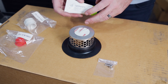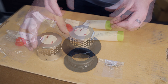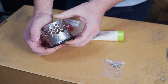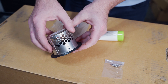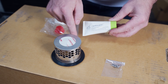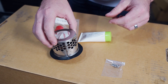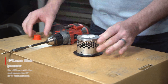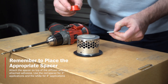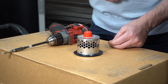It's important to note that you want to lubricate the edge of this to make it slide up into the pipe easier. For a 3-inch application, go ahead and take the diffuser and the 3-inch gasket, slide that all the way up in, making sure it's flush against the diffuser all the way around. Utilize the screws in each of the holes, and make sure you use lubrication all the way around the outside of the diffuser gasket to ensure it goes up into the pipe smooth and easy. Then just take off the tape for the 3-inch diffuser spacer and put that directly on top, and you're good to go for your 3-inch application.